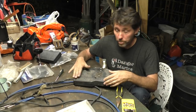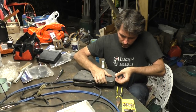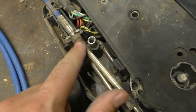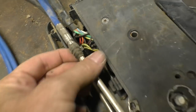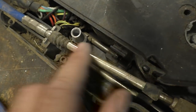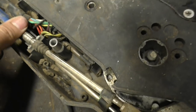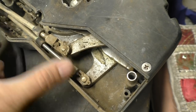There's certainly nothing scary under this bottom plate other than perhaps the wasps I'm expecting to see. In here, along with a lot of mud, you'll see from this end is where the wiring loom comes in. Then you've got your two control cables here. There's a bit of metal here that they slot into. All these universal control cables have a little groove here. Some outboards like the Mercury have a larger kind of rubber plug that goes on the control cable, but this is quite a common setup amongst lots of brands. This particular groove will drop into this bit of metal, and that means the outer casing has a fixed position — that's what allows it to extend the inner section without it all sort of flopping around.